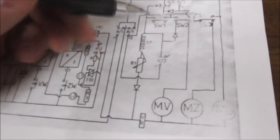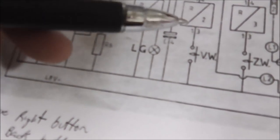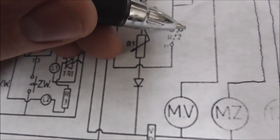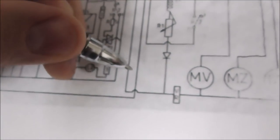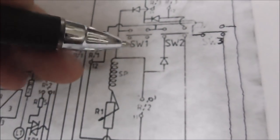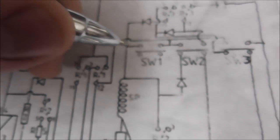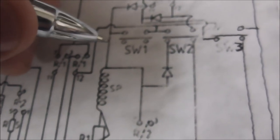Right? So the first one that you move is the one going back, right? So we know that the way that we do that is we hit this button, which turns on relay 2. Well, as relay 2 turns on, this switch closes. So if that switch, which isn't connected to anything over here, closes, you are now sending your ground through here, through relay 2. It can't go that way. How's it get to it? How's it do it?